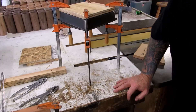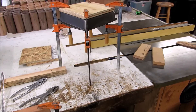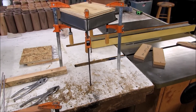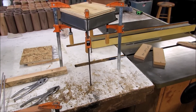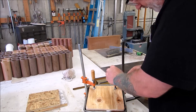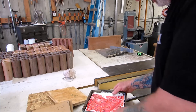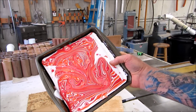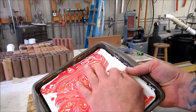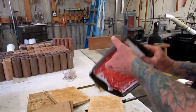That's how to comb HDPE — looks like heck on the top, and you might be thinking what is that guy thinking, that looks like hell. But tomorrow when we plane that off the beauty lies within. It's the next morning — it's looking very promising on the top. You can see how it shrunk away from the pan, there's a gap all the way around it, but it's still nice and flat because we had it clamped in the boards.